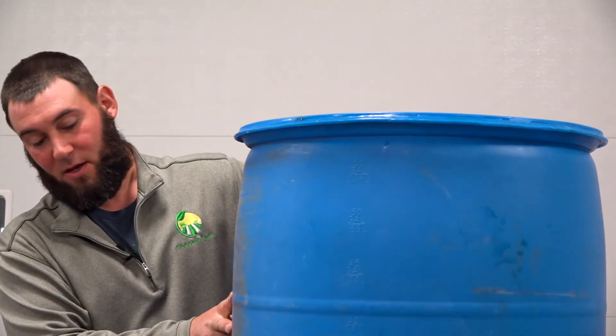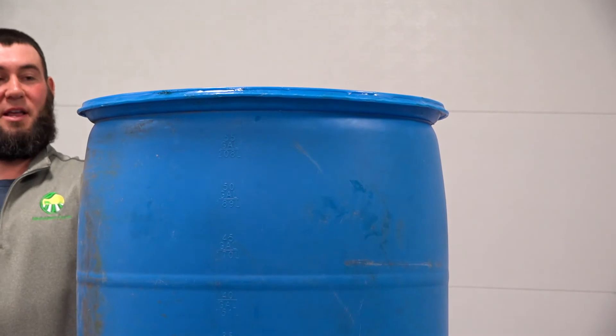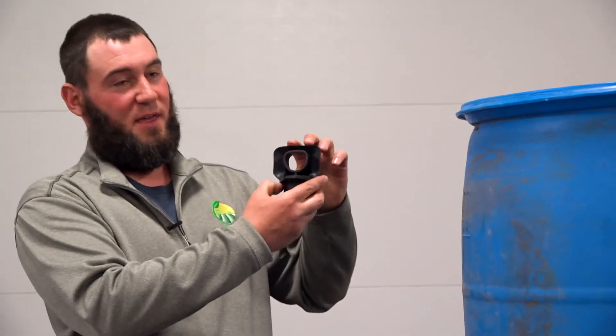If this is sticking straight out from my house and here's my gutter against my house, I'm going to stick the inlet maybe right here at this odd angle. With the large hole saw, depending on whether you drill into the side of your gutter or directly into your gutter, you're going to drill with the large hole saw into your gutter. Then you drill that big hole, bend this in on itself again, stick it in there and it pops out — you can see it makes a cup to catch some of the water. There should be two self-tapping screws, and this big flange will be on the outside of your gutter. Take those two self-tapping screws and screw this to your gutter.